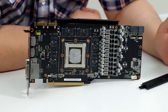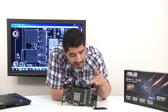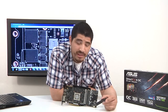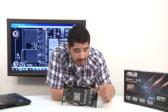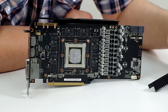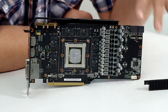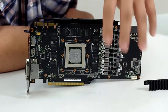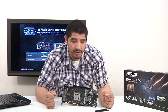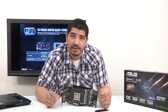It's not just about outstanding power components — it's also about ensuring stability and reliability. The MOSFETs are the hottest-running parts of the entire board outside the GPU, which is why we also provide a full VRM heatsink — removed here just to show you — that goes directly over them to aid in cooling. That VRM heatsink also receives additional heat dissipation benefits from the DC2 design as air flows down and across the finned assembly.